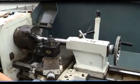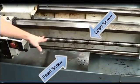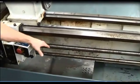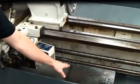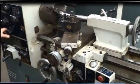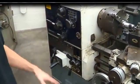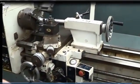In addition to that, the lead screw and the feed screw turn independently of each other on this model. The lead screw is used when threading, and that's what the half nut lever locks into. The feed screw is what is used to dictate how fast it's feeding. We're going back to the headstock where all the feed information is located and the feed selectors, so that dictates how fast it feeds along that shaft.